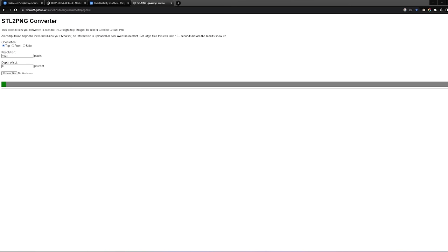We're taking a 3D object and converting it into an image format that LightBurn can understand, and instead of it being a typical grayscale image that we use to differentiate colors and shapes, we're going a step further and using it to generate layers, essentially. It's going to form depth as we engrave down each of those layers. I alluded to this before, but we need to pick an orientation, or essentially a viewpoint, that this web tool is going to look at the object from to determine what the image source is going to be, where it's looking at it from in the 3D space.